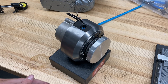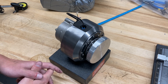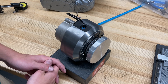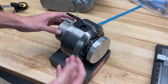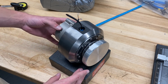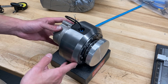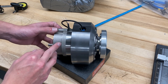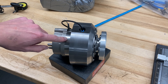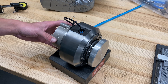The other concern with ultra-precision machine design is thermal effects. The way we're going to combat that with this spindle is basically just passive cooling and allowing things to come to equilibrium. As opposed to having a cooling jacket or a preheater, we're just going to let this thing warm up before it's used. This type of motor is fairly efficient and shouldn't generate much heat to begin with. But due to this stainless spacer and this large aluminum area in the back, it should come to a thermal equilibrium rather quickly.